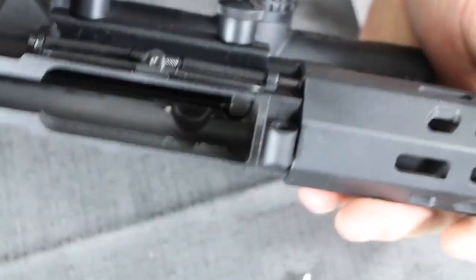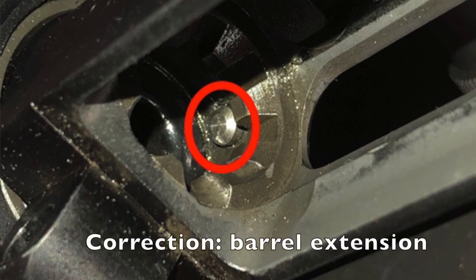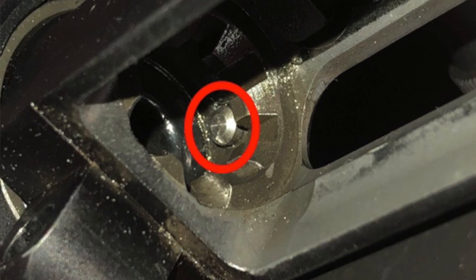You can see the upper receiver is standard. One of the things I also want to show you, you're not going to be able to see it here, but you're going to see a picture of it, is right inside the chamber here. This gun was designed to be much safer than any other type of rifle out there on the market. The same system is used by, I do believe, SIG and HK. But what it has, right in the receiver extension, is a large post. And what that post does is when the bolt goes into the lock position, that post sits over the extractor. So if there was to be a catastrophic failure with the rifle, the extractor would be fully supported, so the bolt would remain in the lock position.